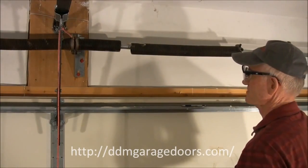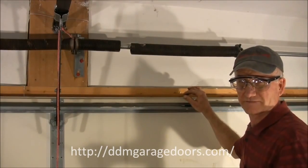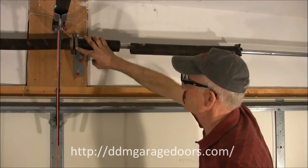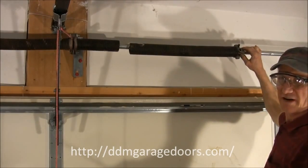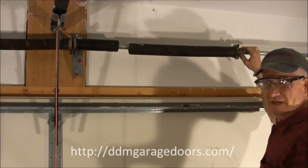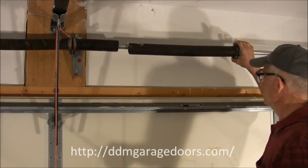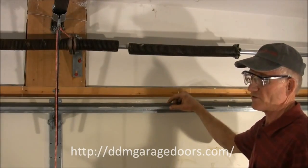Next, determine the inside diameter. In order to determine the inside diameter, it's best not to measure it — coils shrink, expand, and do a lot of different things. You want to look at the cones. If you look at these cones here, we see a 175 on both of them. Also on the winding cone, you'll usually see a 175 as well. If you have two inch springs, you may see a 2.0, 200, or 2000 marking — that'll tell you it's a two inch spring. On two and a quarter inch springs, since the only manufacturer that makes the two and a quarter inch ID springs is Rainer, you'll usually see Rainer's name on the cone, on the brackets, on the hinges, the tracks, and different parts of the door, including the cable drums.